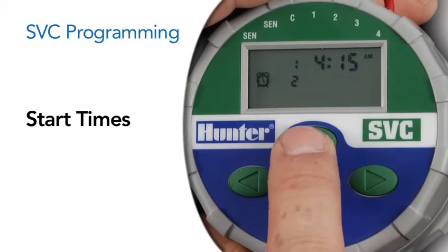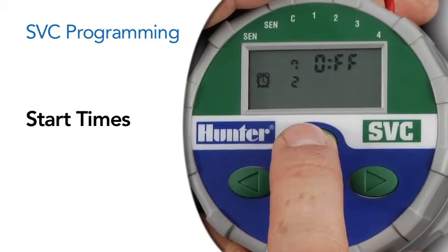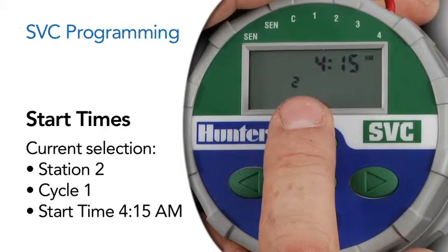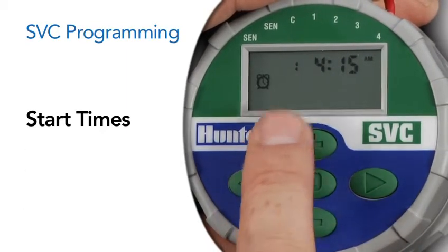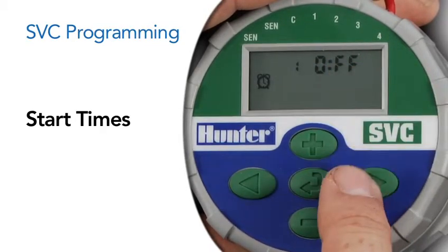Quickly review the rest of its cycle starts and make sure they're all in the off position if you only want station 2 to start once. So we see that it only has one cycle start at 4:15 a.m. Then we can hit the left arrow to go to the station number, use the plus to advance to station 3 of the 4 zones.